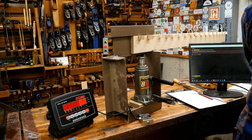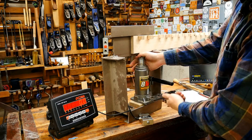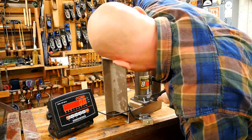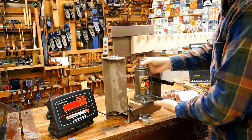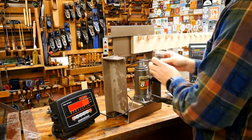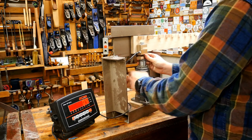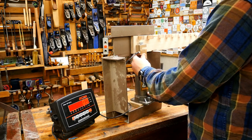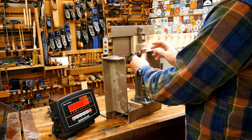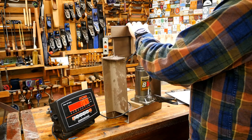We'll go through these one by one and bust them off to see at what pressure they fail. I have a jack here that can apply up to eight hundred pounds of pressure — it usually only takes a couple hundred — and a load cell so I can get an exact measurement. I'm testing them in shear because that's really the only way to test the glue itself; any other method and you end up testing the wood.